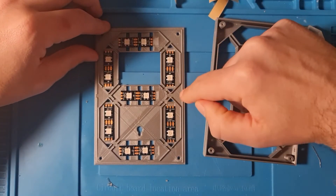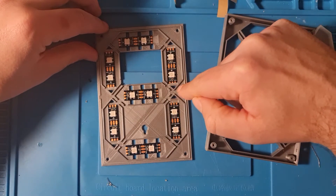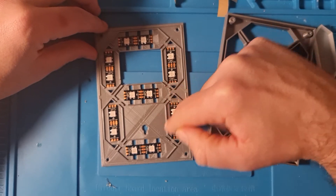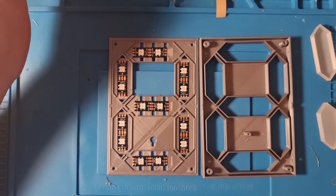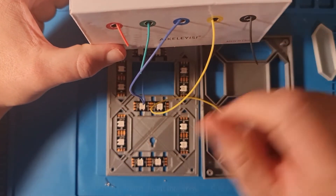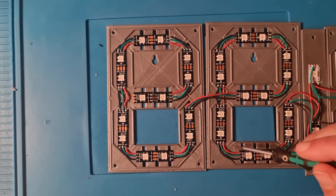That's it — so this is our input side, it's going to go down, down, up, up, up, down, and this will go to my next seven-segment display. Input from the ESP32 with my digital input pin, ground, and five volts, and then out to my next seven-segment display. Always try to keep it color-coded: I'm going to use red for power, black for ground, and green for my digital communication wire.